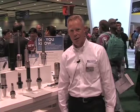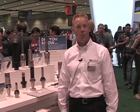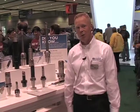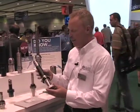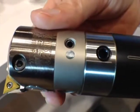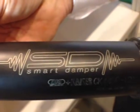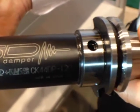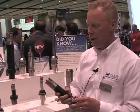One of the areas near to us is Deep Hole Boring, and we have many solutions to offer our customers for these problematic applications. Our newest development is what we're calling the Smart Damper Series of Boring Tools. The Smart Damper integrates a very proprietary damping system, which eliminates all the vibration associated with Deep Hole Boring, making chatter-free boring and less problematic boring occur on routine boring operations.